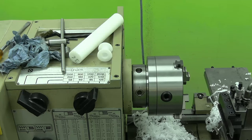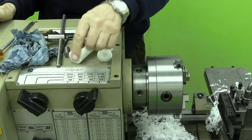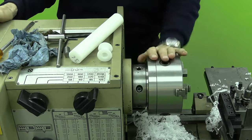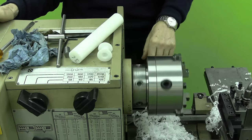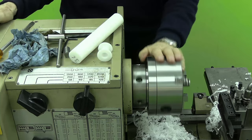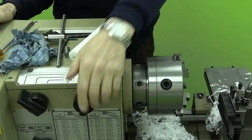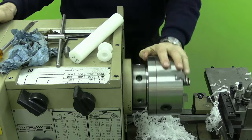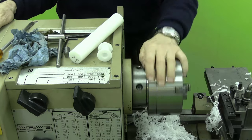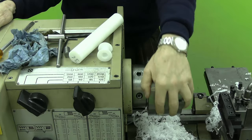Let me show you. So this speed range has four positions. If I have it on this right-hand position, everything is fine. But if I put it on any other position it makes noise. At first I thought it was in the front spindle bearing, but it can't be because it's OK on that position.